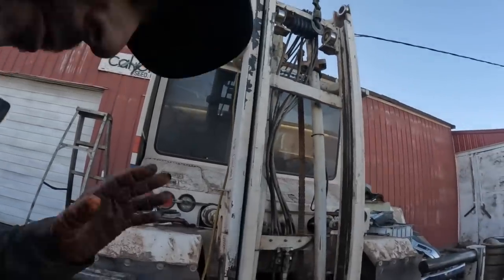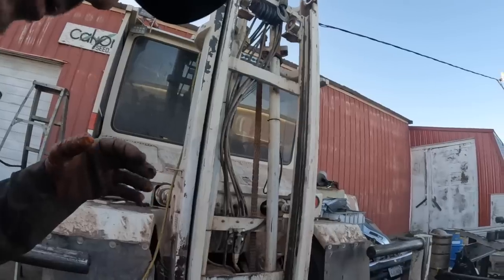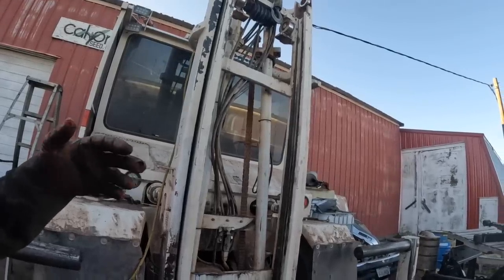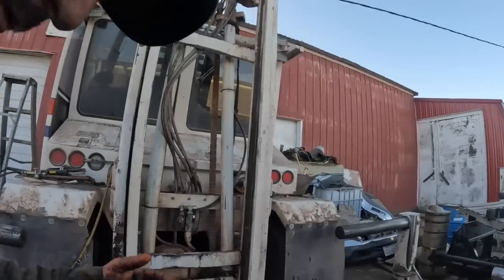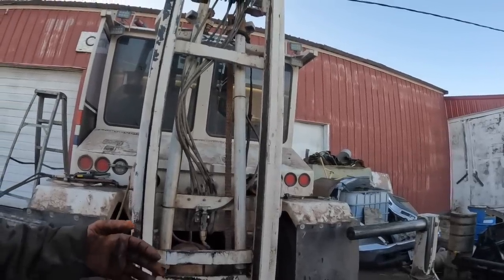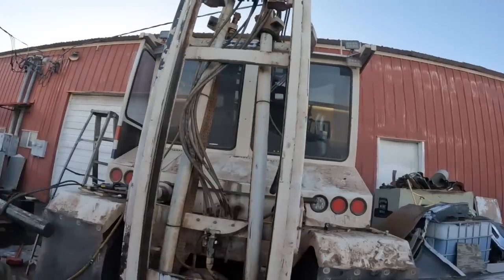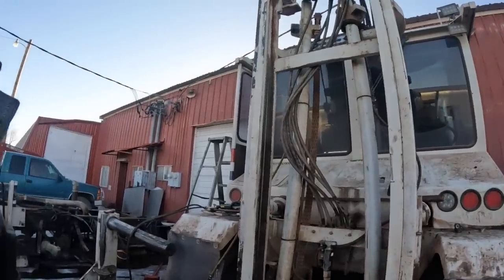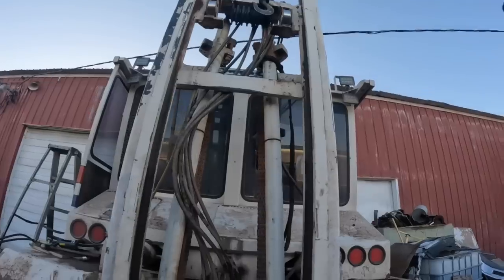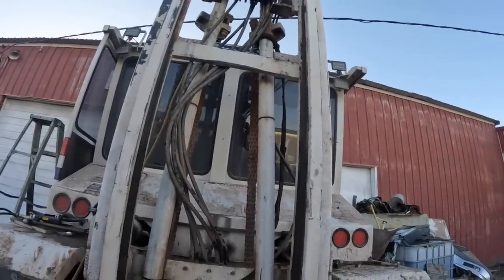I've got to run up there. What I'm going to do is, I think I'll have to do an SCR efficiency test or something through the Detroit software, and try to get it out of derate and then do the forced regen and get the codes to clear, so he can at least go get the thing unloaded while we're waiting on the parts to show up. I'll come back tomorrow, and I just have that one bearing to change.